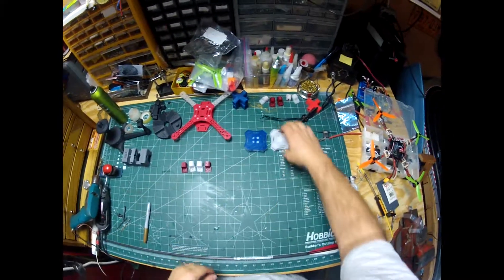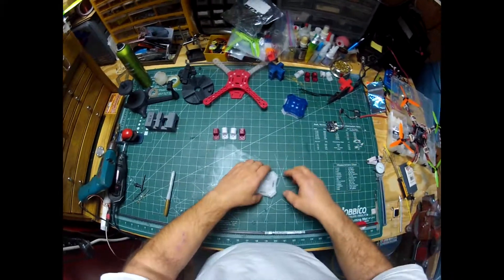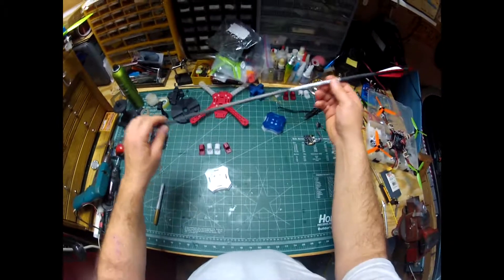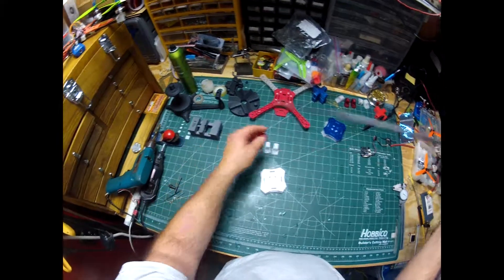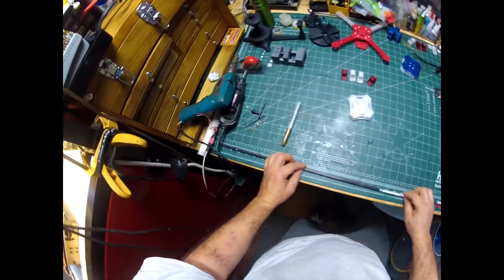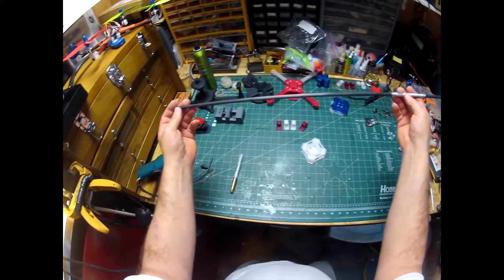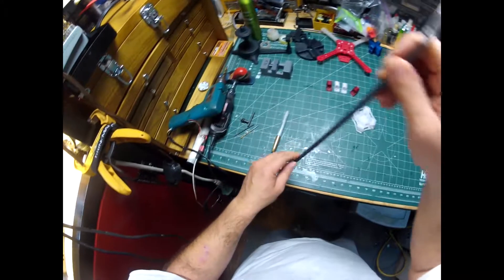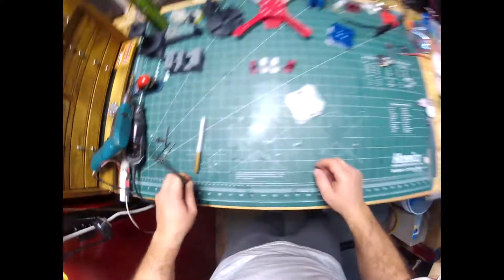On to the quadcopter - I've designed a new center section to hold everything together. I've made these holes slightly smaller because carbon arrows come in different diameters, so I left a little room for you to play with. Drill out to get the appropriate fit. The fun thing about this design is you can tailor the arms to whatever you want. You can buy one of these arrows for five or six bucks a piece, or you can just buy seven or seven-and-a-half millimeter carbon tube from anywhere.